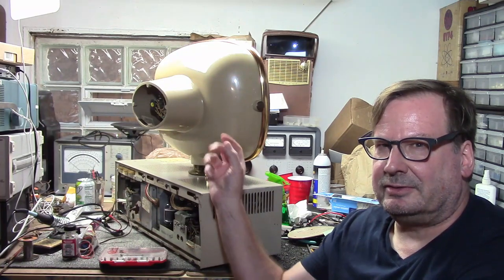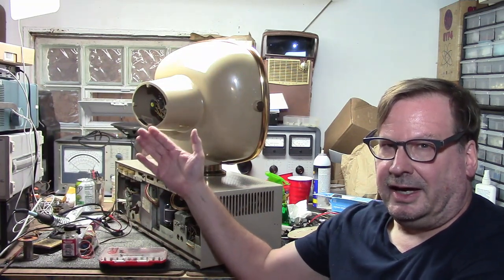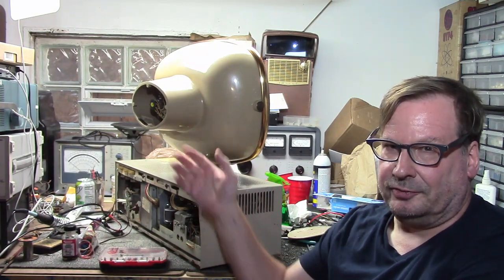Now there is one physical difference you may very well have to deal with, and that is the length of the neck. The originals have a really short neck. There are one or two, maybe three 6.3-volt versions that have a similarly short neck. There are several that are a little bit longer but will still fit, but there are definitely some that are longer and will protrude. You're going to need to either leave the cover off, add some spacers, or 3D print a new one that has a bump on it. It will not fit inside the housing, but they'll work fine. Given the scarcity of them, it's definitely worth a little bit of physical modification — it's on the back so it's not very visible. Given the choice between modifying the back a little bit and not having a functioning TV, I'd go for the modification.